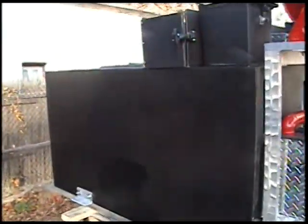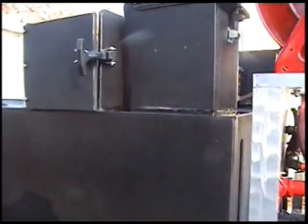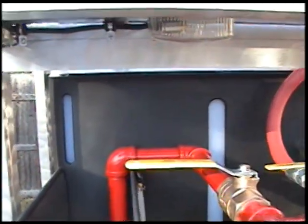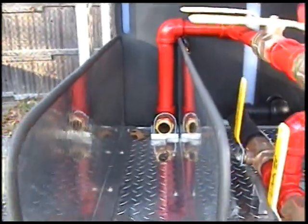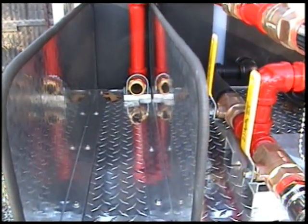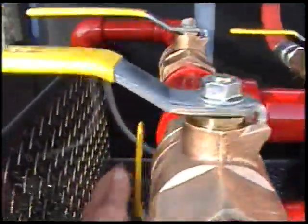First of all, you have your polypropylene tank, 250 gallons. It has a little extra because you have a compartment up above for tools if you want, 9x9x48. It has 5 gallons of foam, 250 gallon sight glass, an inch and a half pre-connect, which will give you roughly 150 feet of hose.